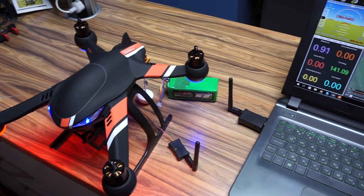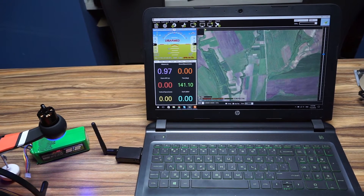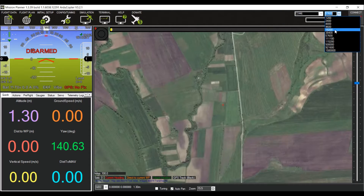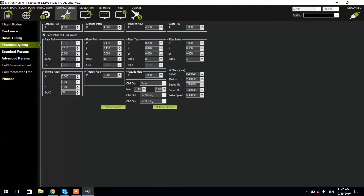The telemetry will definitely greatly help in this situation. Once that is connected, you have to start Mission Planner on your laptop. Select the correct COM port, select the correct speed, and click connect. If all is good, you will see this happening and the parameters will start to load. Depending on how this is set up, it may take a bit longer. The switch is in the correct place and telemetry is working.